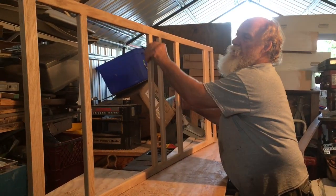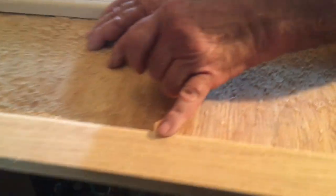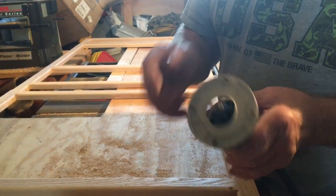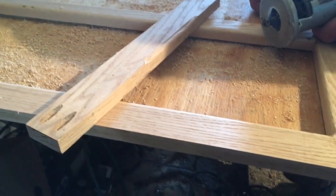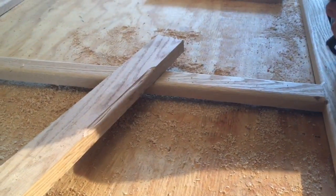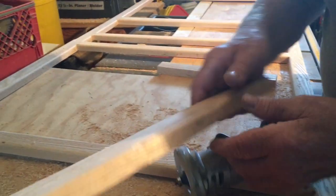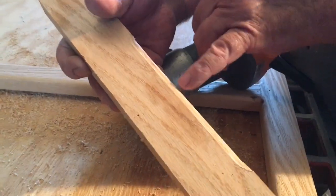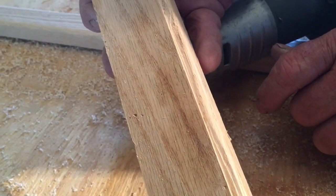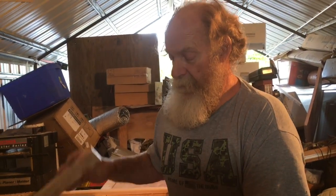On the front we try to round everything off. If you look here, this one's rounded and this one is just a sharp straight edge. This router right here is called a half round, and that's what does the rounding. On your routers, you always need to check the adjustment prior to using it — you loosen this and adjust it, push it up or down, then tighten it up. This was just a little too far down and you can see this lip right here. Each wood is a different thickness, so it would have left that big line and you'd have to sand it all.